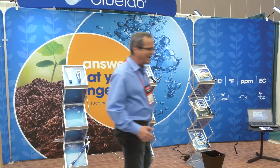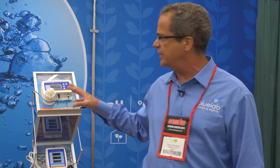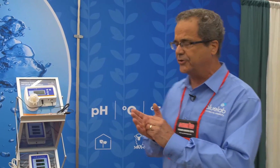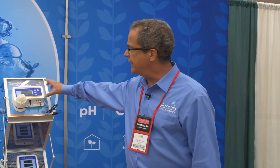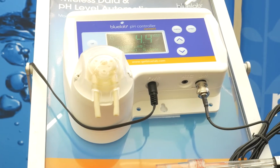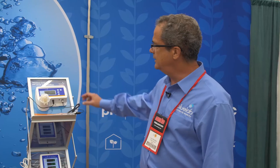If you step down here, these are our Connect meters. You can notice the orange bands on each one of these meters. Each one of these meters lets you download your information to your computer and have a data log of what's going on in real time. Our pH doser will dose either up or down depending on what your needs are — it will dose to keep your pH exactly where you need it to be. You set your high and your low, and you can have a one-second dose or up to a 60-second dose, then set the timing so you can get circulation and analysis.